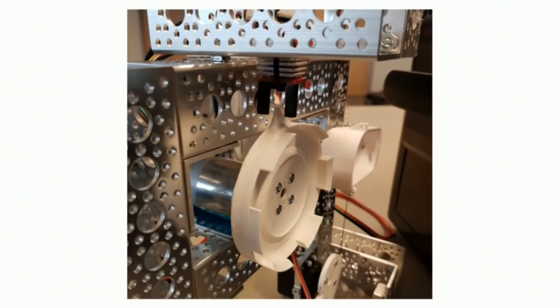We use that in a photo gate. There's a photo gate attached to the Arduino that looks for that flag and sees when it breaks the beam. When it breaks the beam, it knows the flag is there, and then it asks the human, hey, what number am I at? And the human types in 62 and says, okay, I know where 62 is. It can immediately go to zero. So it's a way that we kind of calibrate and home the dial.